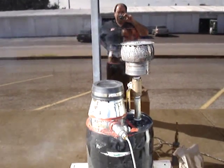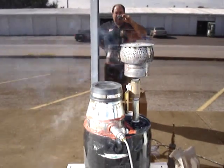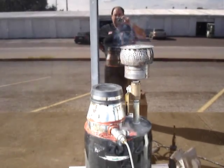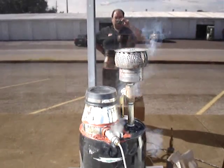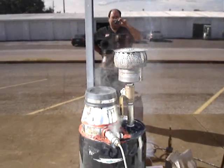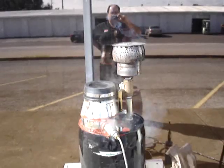There were some gaps and some voids around the J-tubes going into the reaction tube. There was a gap around the restrictor plate in the bottom of the reaction tube, and I could see how tar could sneak out there without going through the hot zone.